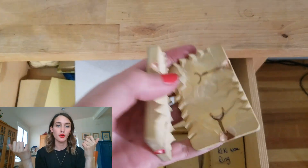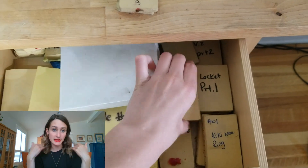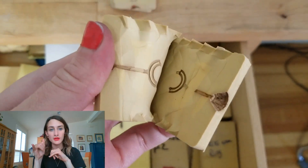These septum jewelries are made from molds, just because they're standard sizes and it's a lot easier. As you can see, these are little rubber molds that we then inject with wax. We take the wax piece out and then we cast it — we melt it into gold — and that's how we get the base shape.